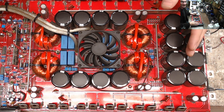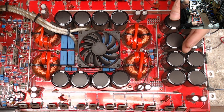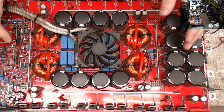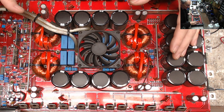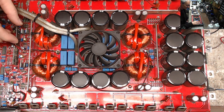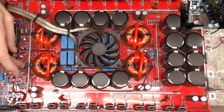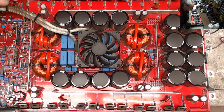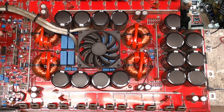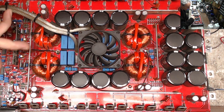These S&I designs use the MIC 4452 drivers coming off of an IRS 284 card. This is a Crescendo 17K, so it has two cards. On a normal S&I you'd have a high-low set of drivers for each card, but that's not how this is done. You just have one high, one low for each half — actually each quarter — of the amplifier.